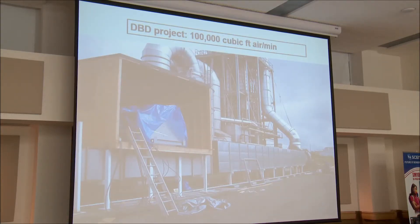Here's your non-thermal plasma system. This duct is six foot by six foot — this is 100,000 CFM. We go up a stack. The stack has a dispersion level of about 200 to 1. We're using just 30 kilowatts to treat 100,000 CFM here. The bulk of the air doesn't have to go through the electrodes — it's only a small amount of air, probably about 15 to 20,000 CFM going in. Fan curves were how I estimated that. The bulk of the air goes underneath.